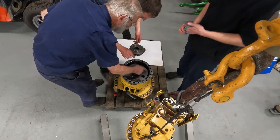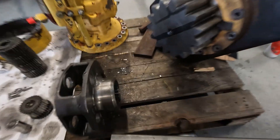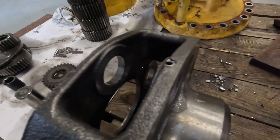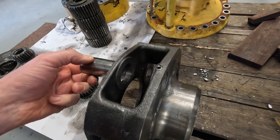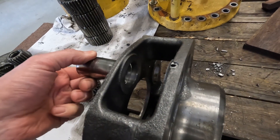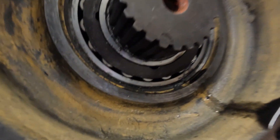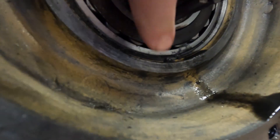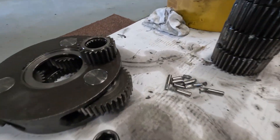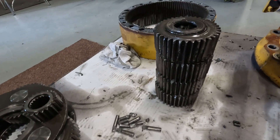The roll was out of the bearing. The pin's sheared off or something's gone — the pin's dropped down somehow. So it looks like we're in a bit of trouble with this one. What's happened is this pin here is held in by a pin through there, and a couple of them have sheared off which let the pin drop down — it was just scratching the housing there, which hasn't hurt that too badly — but it's let some of the needle rollers out which run round this pin inside these gears, and it's basically crunched it all up.